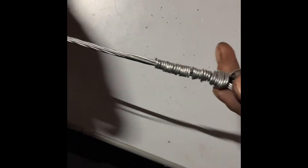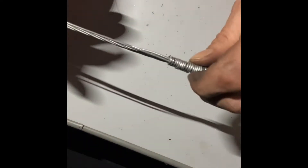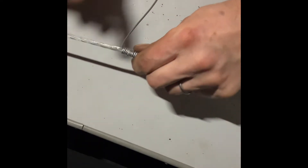We've done six of the wraps and now we're down to the last wrap. This is the straighter one I mentioned — slightly bigger and straighter. This is the center core which is a straight strand. When they make this wire, this will be the first strand put in — dead straight — and the other ones wrap around it. This wire is newer, quite flexible, and stays in position. It's quite hard to snap with your hands but it keeps a nice bend. This last wire is roughly about a foot in length, which tends to be about the right length.